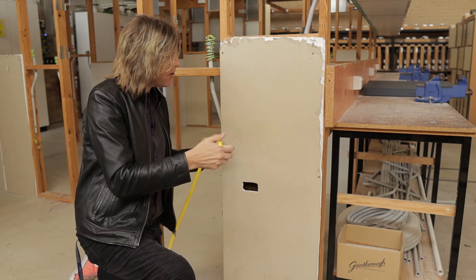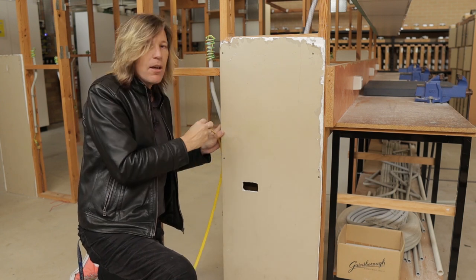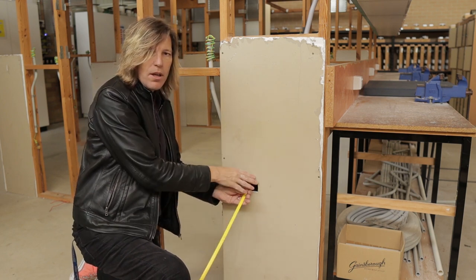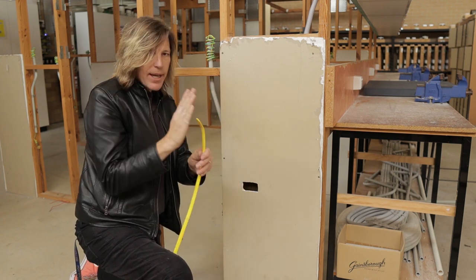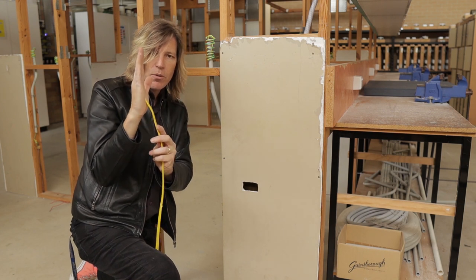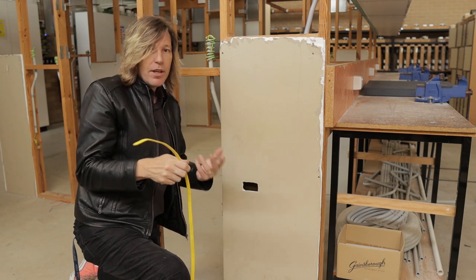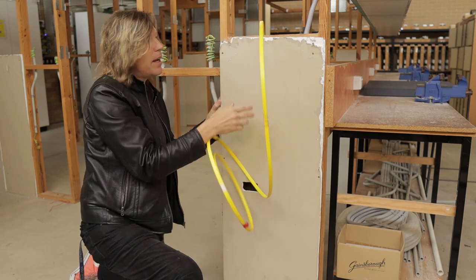This is really handy because if you have a wall with insulation inside, you can't just drop a cable in — it's going to get stuck. But if you give the tongue a bit of a curve, when you put it through the hole it will go up against the inside of the plasterboard, scrape along between the insulation and the plasterboard, and go through quite easily. It works even without insulation — it's a really good tool.